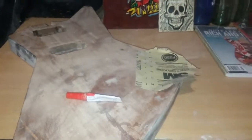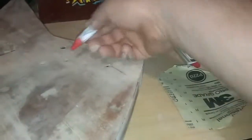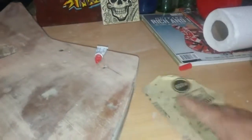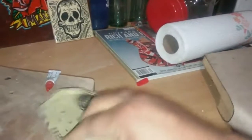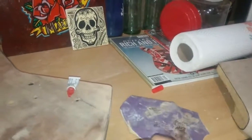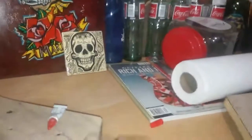Okay, you take your CA glue — which, for people who don't know, CA glue is super glue. What you want to do is, before you put the super glue on there, sand the spot like this to get some sawdust going. See the sawdust? Try to put as much sawdust on top of that hole and try to get it down in the hole.